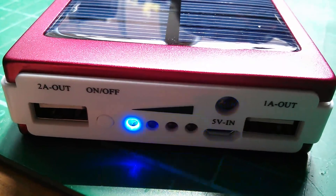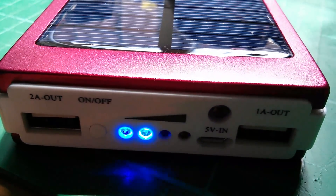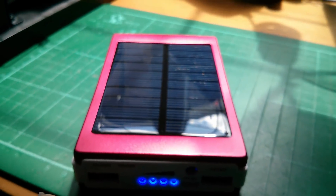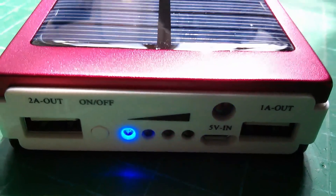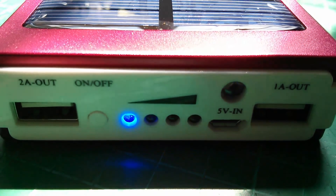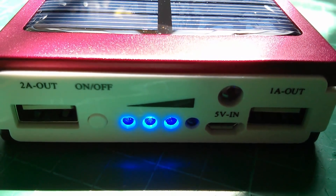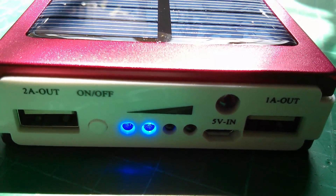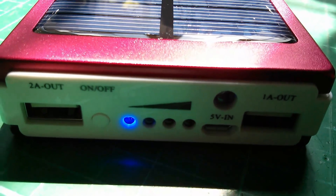You can see that the four blue lights are doing very strange things. They're meant to increment one, two, three, four, and some of the time they do. When the sun is strongly shining on the solar panel the lights do seem to behave — they increment one, two, three, four. But if the light level drops it does really weird things, and it's fairly obvious that it's not properly charging when it's got anything less than full sun on it, and that is a bit of a problem.